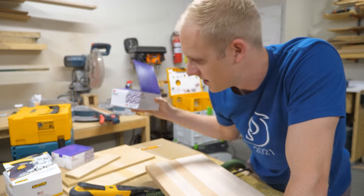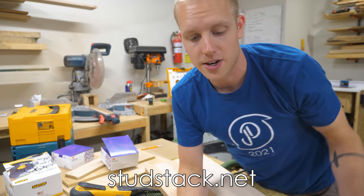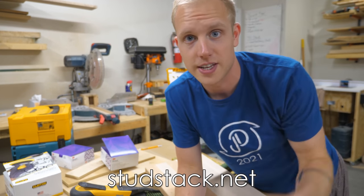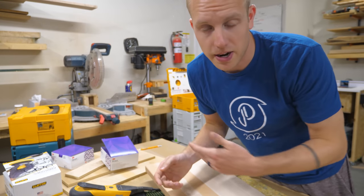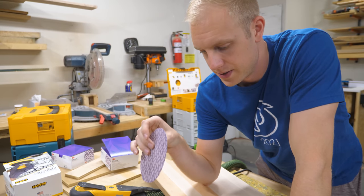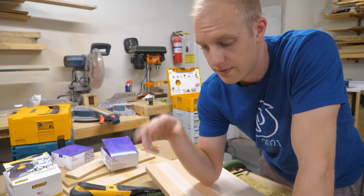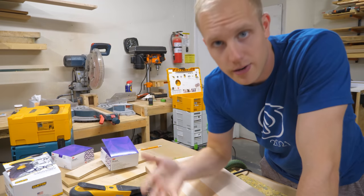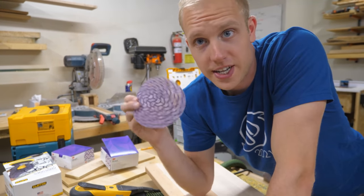I'm going to be giving away these discs in the Stud Stack, so if you've been thinking about signing up, here's another giveaway opportunity — we're always trying to add value to the group. There's a link in the description. I also want to say there's absolutely nothing wrong with these discs — both boards turned out just fine, they're going back in the pile and we're still going to ship them to customers. I was just expecting the new 3M disc to not have some of the characteristics it had — most notably the wear, the residue it leaves on the board, and the fact that it just didn't get scratches out as well. This is for our shop with our tools for our process on our product — so maybe your product is different.